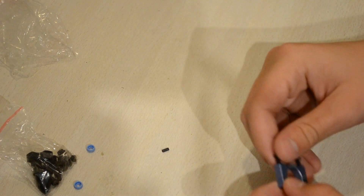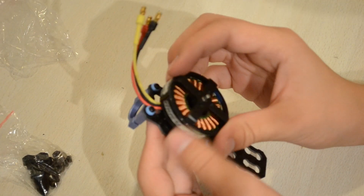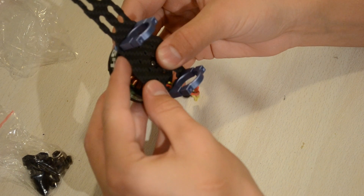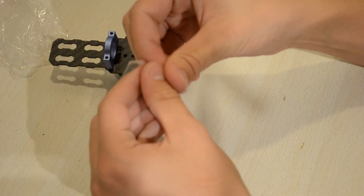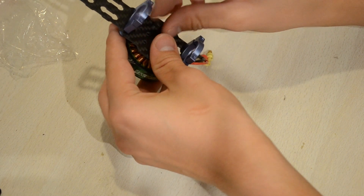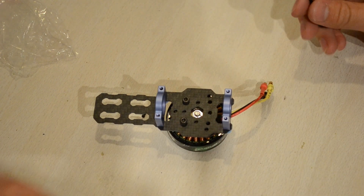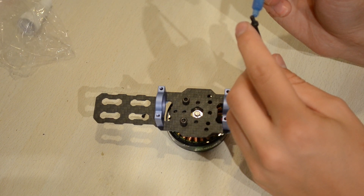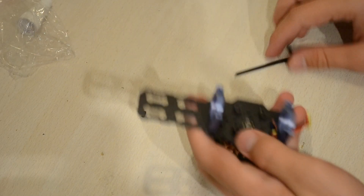Do that same thing down here. Don't screw these completely in. Now go ahead and mount the motor — opposite to what you might think — so the wires are going to come out the back, and there's a reasonable explanation for that later. Get your bag of screws that come with the mount and screw them up from the bottom of the motor mount. Grab a bigger allen key, put on this bolt, take some loctite, apply a small bit to the bolt, and screw it in. Do that for the four other bolts as well.